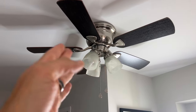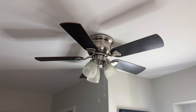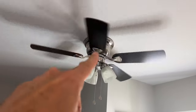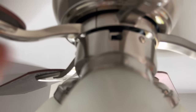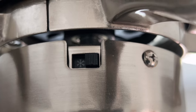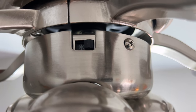Ceiling fan — now let's flip this switch and see what direction this goes. That's going in a clockwise direction. Now let's take a look at the switch up there and see if this is for winter or summer. We'll hop up here and stop the fan. Now if you go up here, it's going to be somewhere around this area above the light, above this base — you're going to see a switch. There's a snowflake on that. Spinning clockwise with a snowflake means this is for winter.